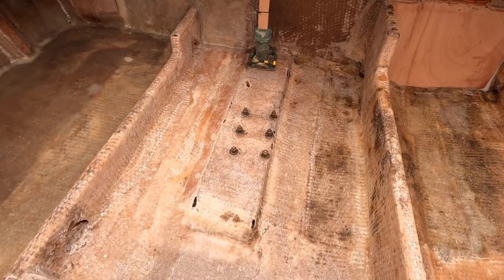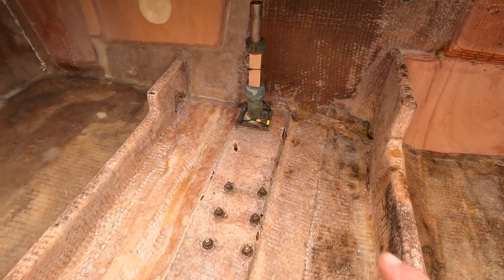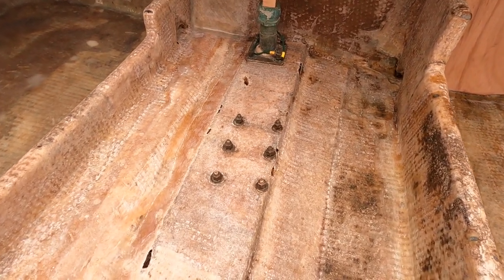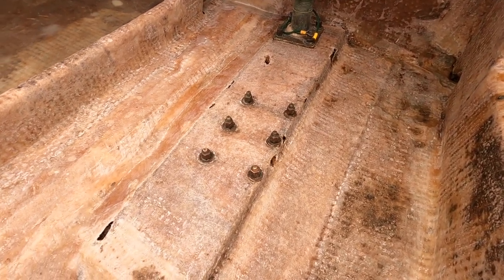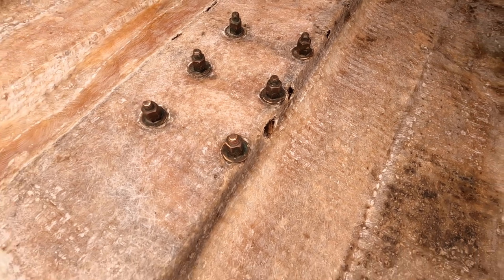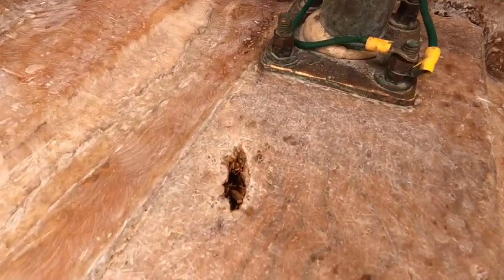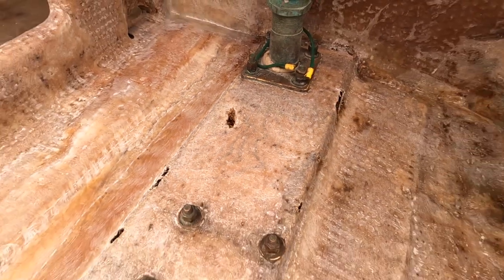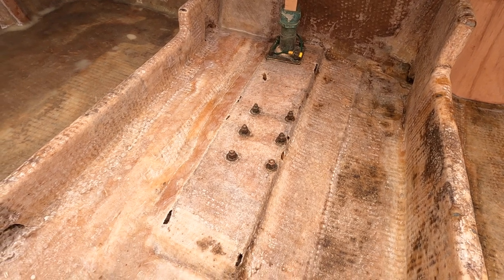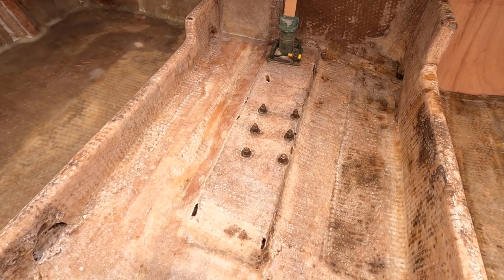Okay, so one of the things I have to deal with here, and I thought I was all done with this grinding and sanding, but as I started poking around here at the rudder, and this is where the strut is for the prop shaft, those little bolts holding it on are all at weird different angles. The fiberglass is pretty thin now because I ground it down, but you can see all the Swiss cheese holes in it. And what I was finding was just wet plywood in there. Actually wet. This boat's been out of the water for 11 years, and out of the rain, I've had it covered, and it's still wet plywood. So anyways, I have to replace that whole chunk of plywood there on both sides. I haven't checked the other side, but I'm just going to do them both anyways.